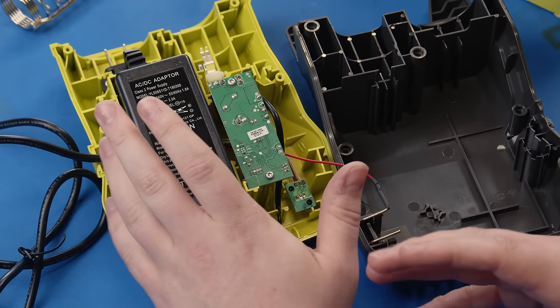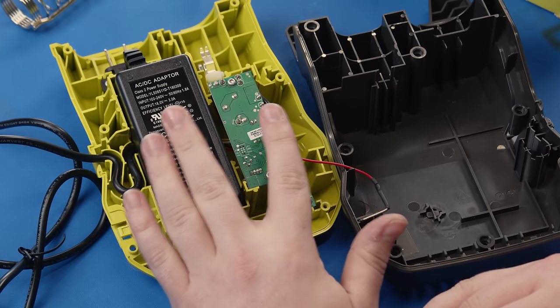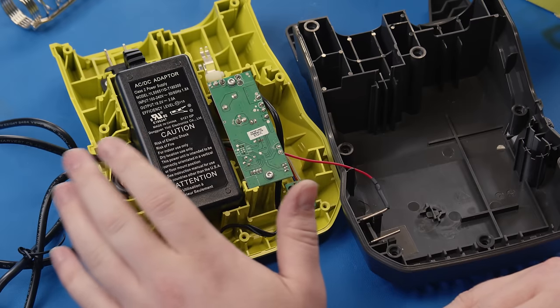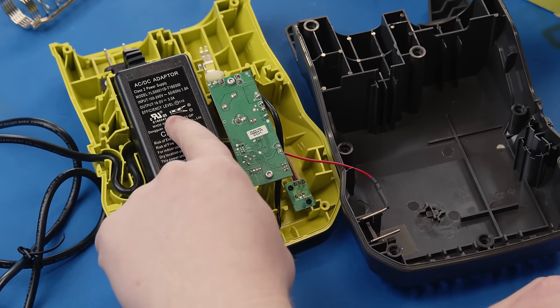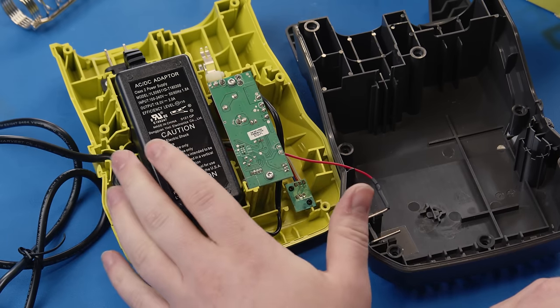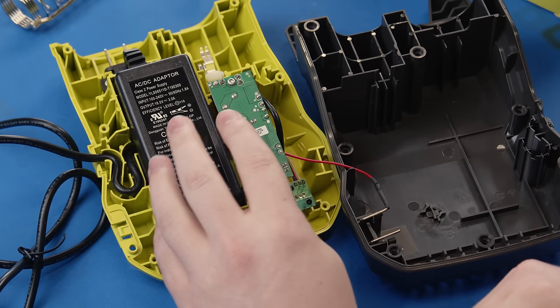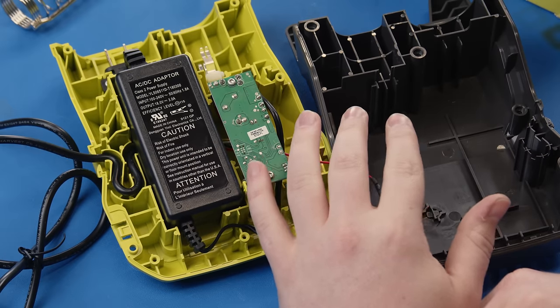Now, before we get too upset here, we should review the nomenclature on the back, because they did not actually just buy these off the shelf as laptop power supplies or whatever. This didn't come with a DC barrel jack on it, because that is a diagram showing you which of the bare wires is which polarity. So this thing came with bare wires on it. That probably means that it was meant to be used industrially, purchased and then built into something that a consumer would buy.